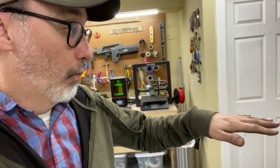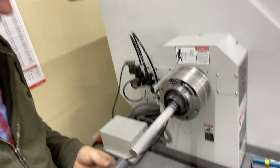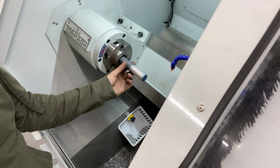And now I've got some 3 foot long stock, as you can see right here. And so I'm almost ready to hit go and let it make a whole bunch of parts out of a 3 foot long piece and just watch it go. On my manual lathe, I made this bushing to go on here and ride in there so that the vibration of the spinning bar isn't that bad. And then I made another one right here that'll go and rest there inside the spindle right here.